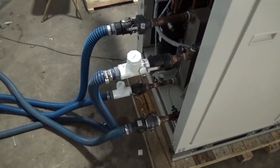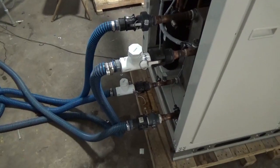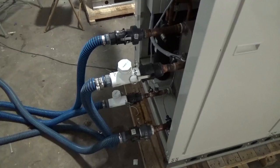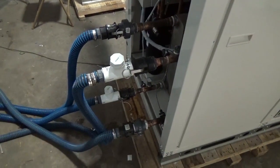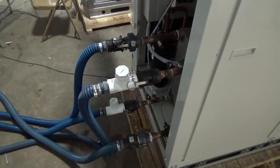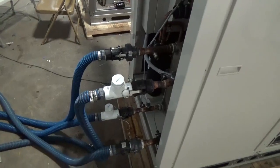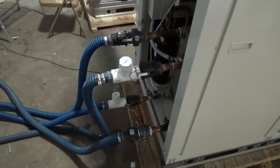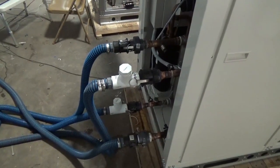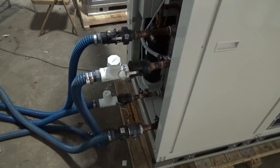You can actually exchange with ambient air or a ground source — like a geothermal ground loop. That could be a stored water tank or a traditional geothermal loop line, and it does that automatically based on what is most efficient. If it's really hot out it'll go to the ground loop; if it's really cold out it might go to the air loop for exchange. It's hard to convey everything this thing is doing in one video, but it is doing something amazing.